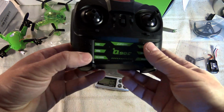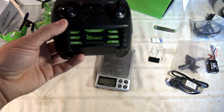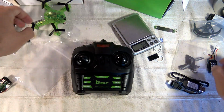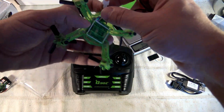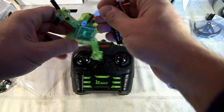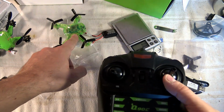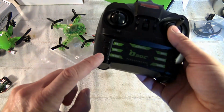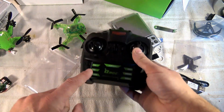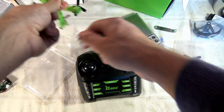Here on the bottom is the channel button. If you short press, you will cycle between the 8 frequencies of the Raceband. Each time you cycle, I can turn it on, and a sequence of blue light is emitted. One blue light on the right means that you're on the first channel. When you press again, there will be 2 fast blue lights, and so on until 8 for the last channel.